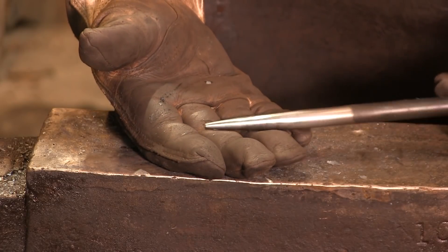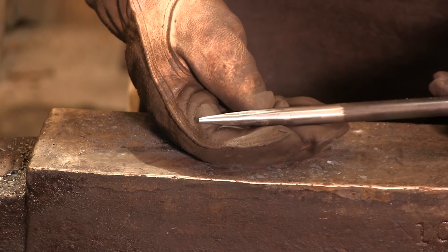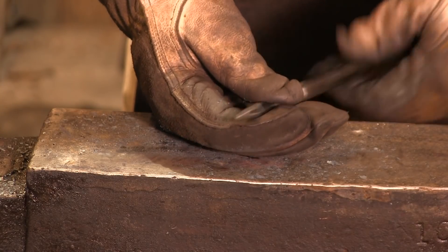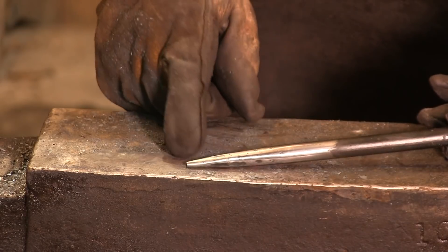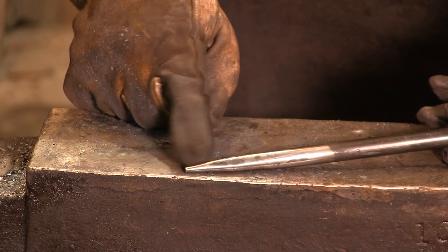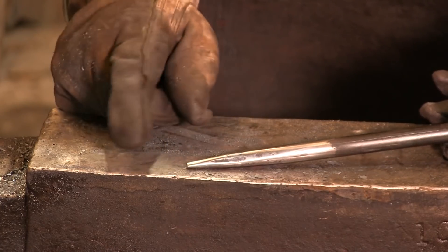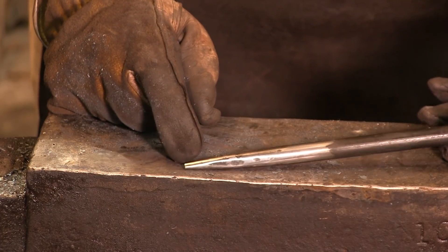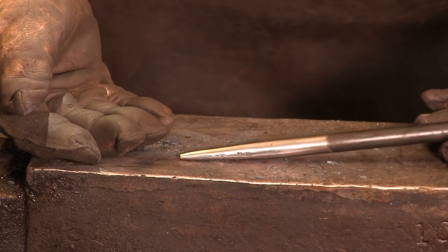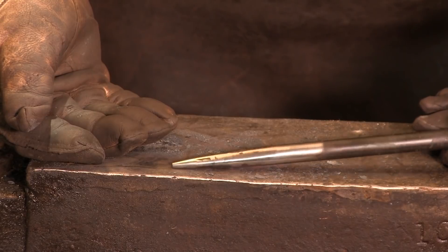Taking a look, you can see she is dressed up and super shiny - I thought it looked cool, no other reason. We've got about three-sixteenths of an inch on that bottom right there. When you're doing yours you can clean it up with a file. The only part that really needs to be clean and polished is right there on the end, because if it's got a bunch of gunk on there when you drive it through it's going to tend to hang. If you're doing thin stuff like quarter-inch that shouldn't matter much, but in something like half-inch or thicker that's going to be a real problem. There she is.